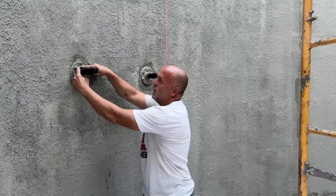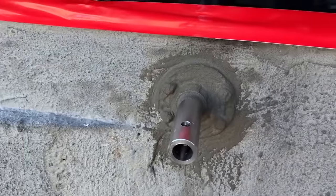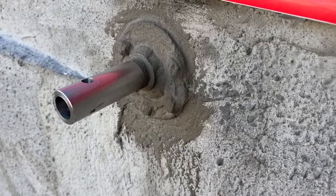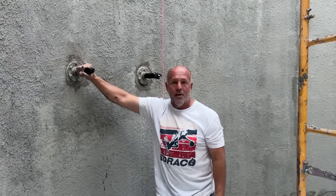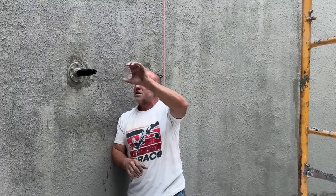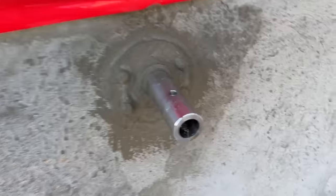And because it's inside a pocket, then we could weld it out right here, and then it steps down to a smaller size. We went ahead and bored out the middle a little just so when we fit drilled, we wouldn't have to drill through solid stainless, but it's still quarter inch wall tube now. And this ladder can be craned in after we plaster, and it just slides onto all of them perfectly with pins going in the top.